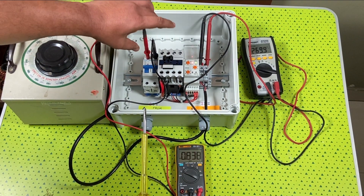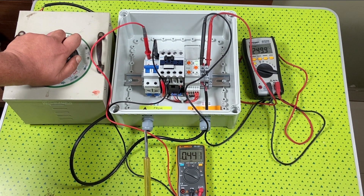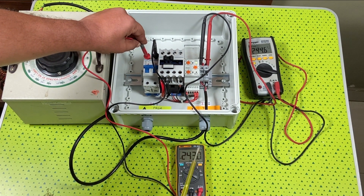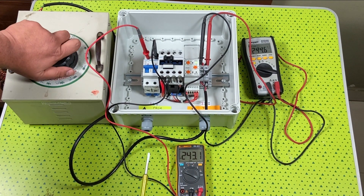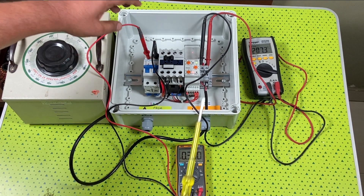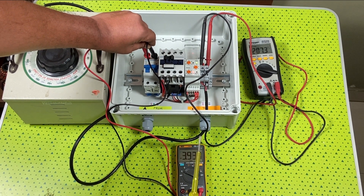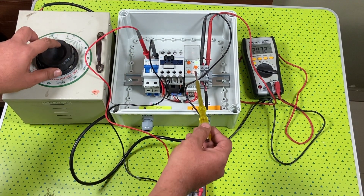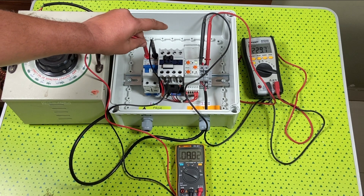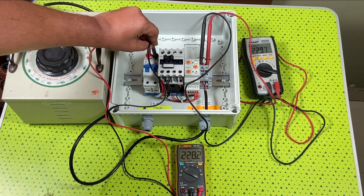We will now try to get back the voltage by reducing it from the transformer. Now it is about 240 volts and there is a reconnection — voltage is appearing on the microinverters again. In the same way we can reduce the voltage. Going down through 220, 218, and the voltage has gone to 207 volts — that is below a certain threshold — so the microinverters have been cut off and it is showing under voltage. Now bringing it back up to 226 volts, the relay has connected again and voltage is appearing on the microinverter.